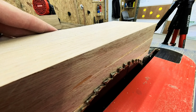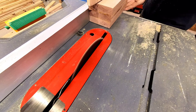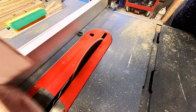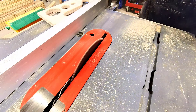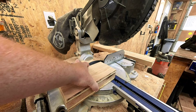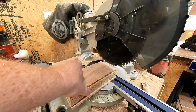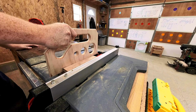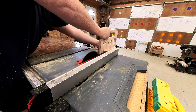For the bigger pin holder, I set the saw height to a little over half the thickness since three inches is a lot for my portable saw to do all at once — multiple passes on both sides, bumping the fence to remove the face of my board. Now that we have a flat side to work with, I used the miter saw to flatten the shorter sides. I only made one side of the other pin holder flat and realized I would need the top to be flat as well for cutting the business card holder, so I made that correction.